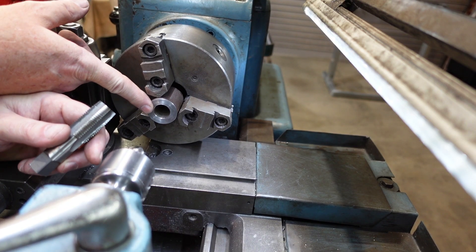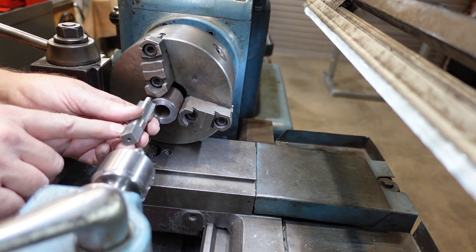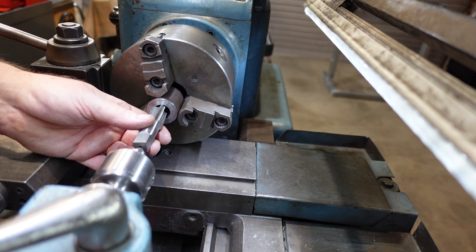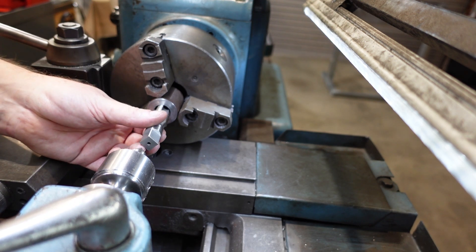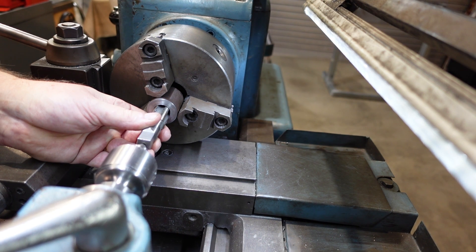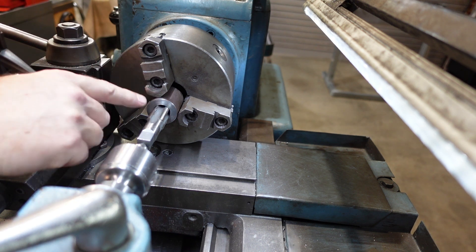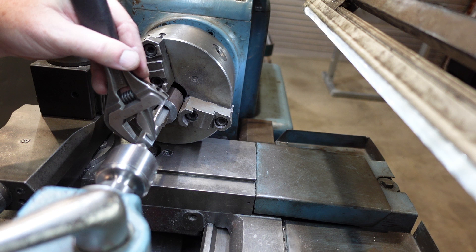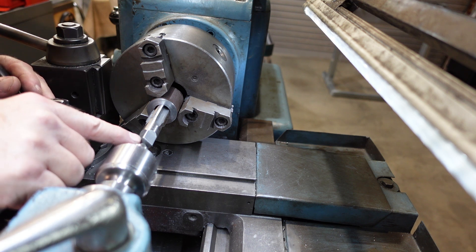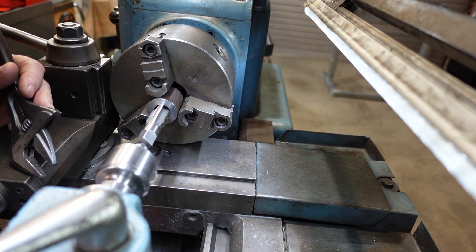To tap the bush, the setup was like this — that's a half BSP tap, and unfortunately it's just a little too big to go into my tap wrench, so I tapped it on the lathe to keep it concentric. If you just put a spanner on the back it'll tend to pull the tap off line, so the dimple in the back needs a center in it. It's a matter of winding it in while cranking the tailstock forward so the center always remains in that pocket, keeping the tap on line — otherwise it'll gradually veer off and you'll get a drunken thread.